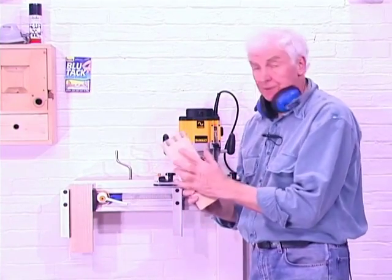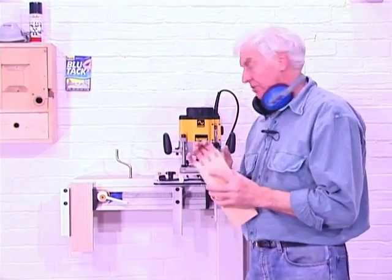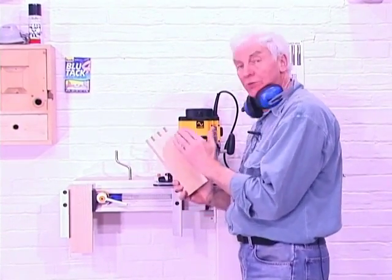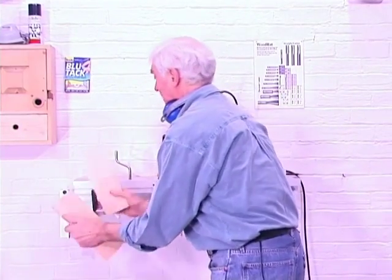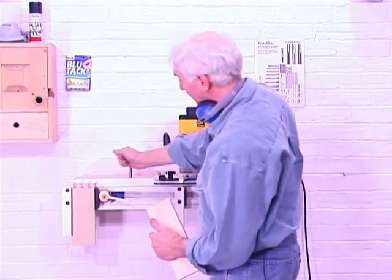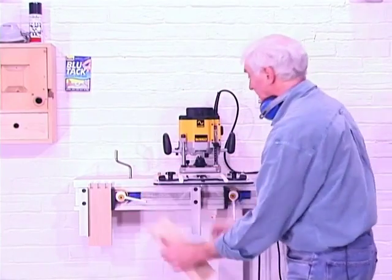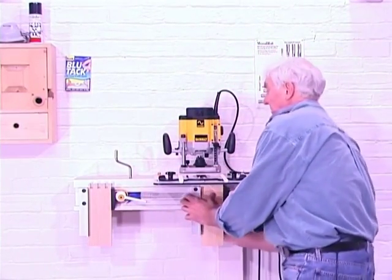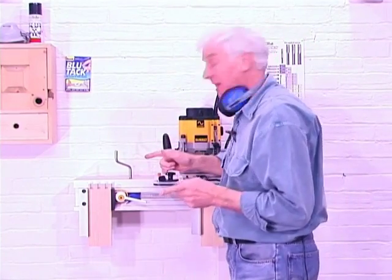That's the first part. What about the second piece? Well, there's no need for any drawing now, because if we put this piece into the marker position here, that will act as a template. Each part against the mark will show us where we cut the second part. In other words, you're making your own template as you go along.